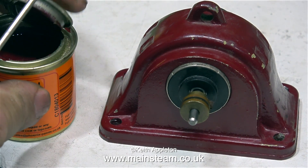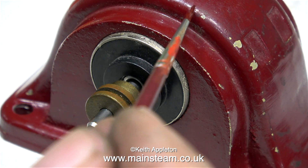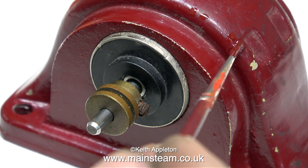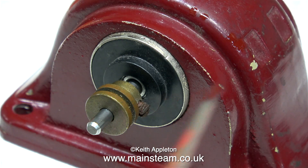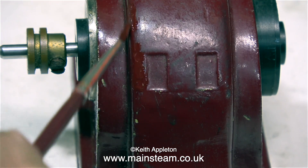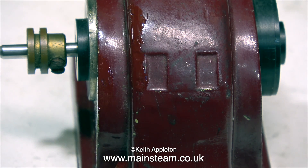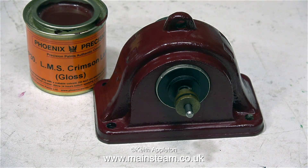This is only going to be a short sequence — it's a very simple job and anyone can do it. After I shot this clip, I stirred the paint for several minutes, and now I'm carefully touching in all the damaged paintwork. The way I would normally do it is to touch in the chipped parts first, only using enough paint to fill the chips. After I've filled all the places where the paint is chipped, I'll leave the paint to dry for a while. As the paint starts to dry, it spreads out a little bit and fills the depression caused by the chips. And once the paint starts to go tacky, I quickly brush very lightly over the top, so I don't dissolve the paint I've already applied. Then I will very lightly brush over the entire area between the edges. I've found this to be quite a good way of painting old components — you can't see any of the chips, yet it doesn't look like it's been freshly painted.